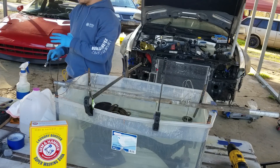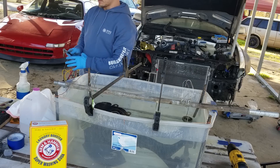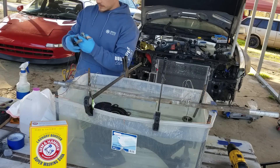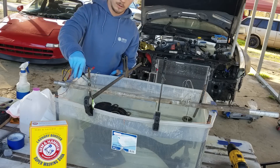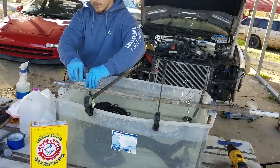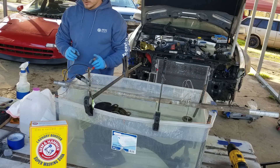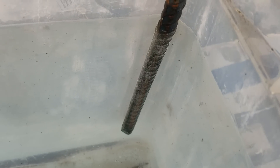So I have a battery charger here. It's an auto-sensing charger, so I'm not sure if it's actually going to work — I may have to get a different one, but I'm going to try it. Before you plug your battery charger in, go ahead and set up your terminals. My positive is going to go to the copper wire and my ground will go to my part. If we get it right, we should get bubbles. Oh, cool! Can you guys see that? That means we did something right.